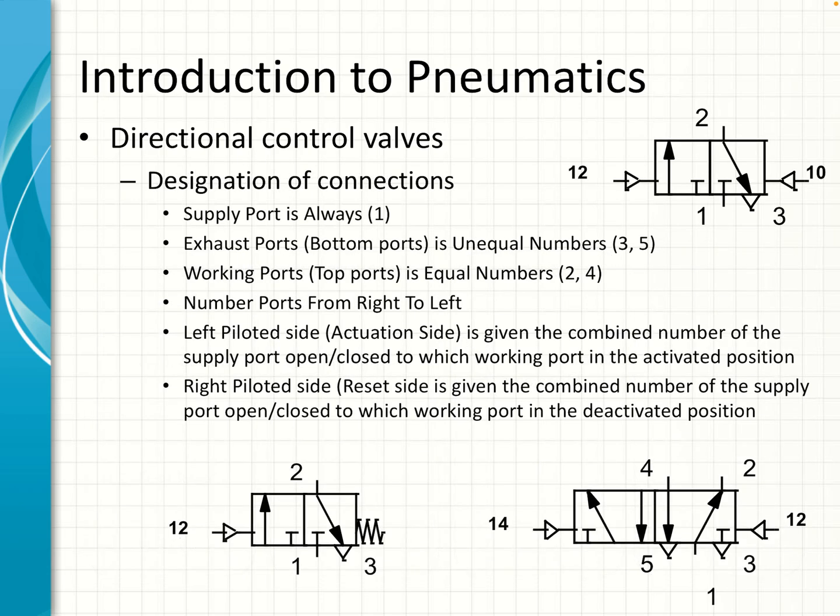There's more information we need to know about a valve's designations and its ports in order to put it into a circuit diagram. These are called directional control valves because they change the directional flow of air in the circuit. We already know we've got two positions shown by blocks and a number of ports showing how many connections we have. In the valve on the top right-hand side we also have pneumatic actuation, with ports numbered 10 and 12. Your supply is always number one — that is where the air comes from the main supply.